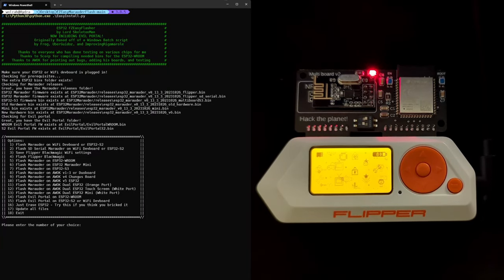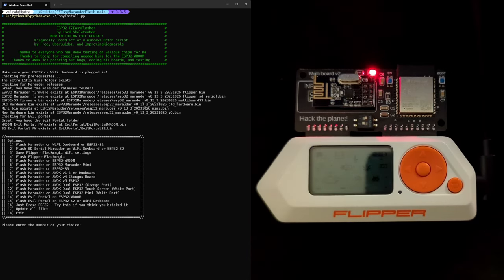This is a video demonstrating how I use the Flipper to flash my Dr. Bork Multiboard's ESP32 with Marauder firmware. It should also work for any other ESP32 based boards and firmwares as far as I'm aware, but I make no promises. I'm going to assume that you have already downloaded the ESP32 Easy Flasher application and set up Python